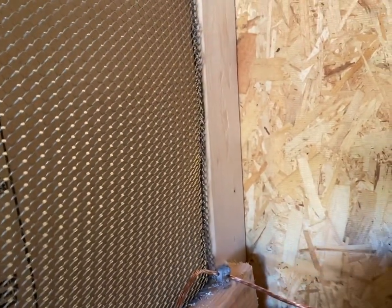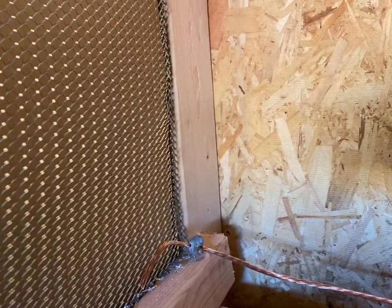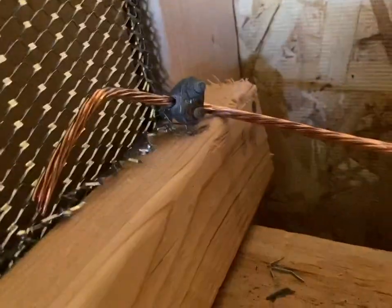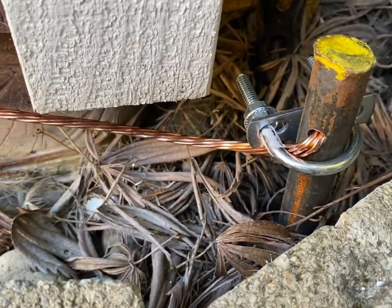That'll direct the incoming energy to the ground, hopefully dissipate it before it travels more inward toward the generator. So the ground wire is done. We used this. And I'll have links to everything in the description to find it easily on Amazon if you want. So we connected the copper ground wire to the mesh. Runs outside the shed to the grounding rod, and that completes the project.